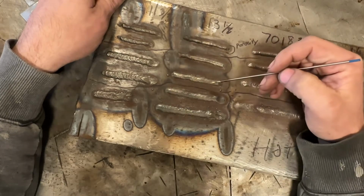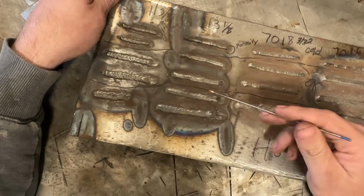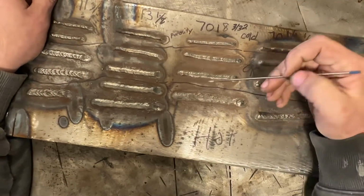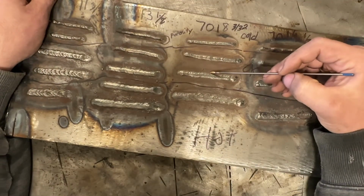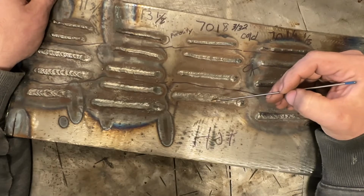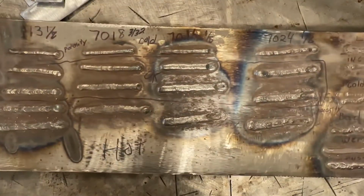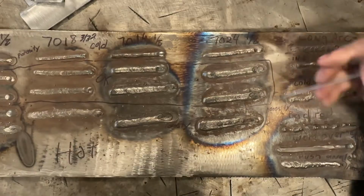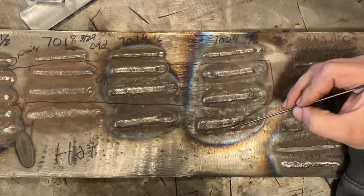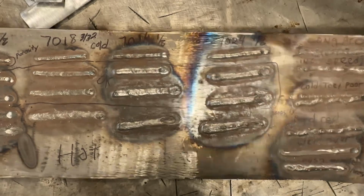But anyways, back to what I was saying. You can see with all of these rods, this is like 6011, I think the 6013, even 7018, you see the same effect. Increasing heat input for the given amount of metal that you're depositing will result in a flatter, more wetted out weld. Same thing with, got 7014, 7024. You can see very drastic difference between too low of amperage, too much, and approximate right amount of heat input.